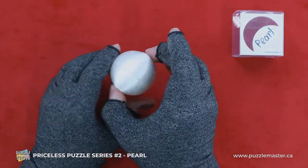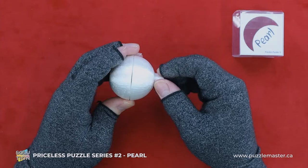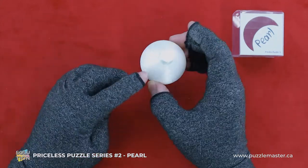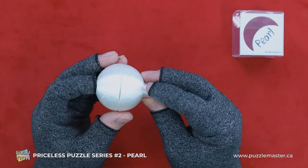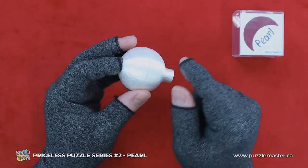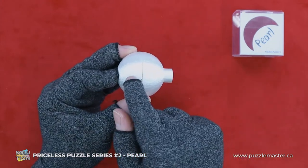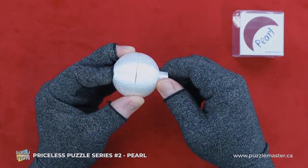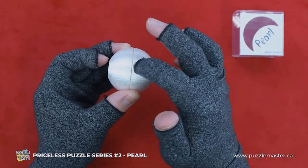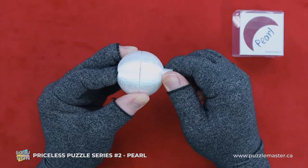To begin, we are going to rotate one all the way out. If we hear a thunk, we're lucky. I can feel that both ball bearings are sliding side by side. So with my one finger I'm going to hold onto this side because it's not held in by any screws, and I'm going to rotate this side in — but it's not rotating this piece because I'm holding onto it. And then when I go to rotate this back, that will rotate my shaft. I can feel that the ball bearing is up here, so once the slot moves into position it should drop in and I'll hear it and feel it.